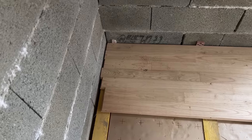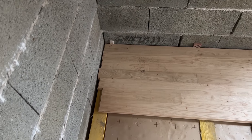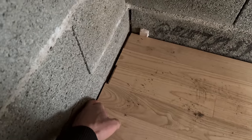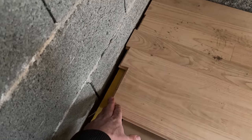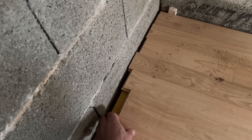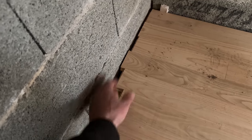I've stopped there for a couple of reasons. I want to talk about why I've left gaps at the side. You can see I've left quite big gaps there — at the end of the day you need expansion space. In summer the wood can move. I'm not too bothered about this gap here because we're putting insulation on the wall and then the rail for the plasterboard, which is probably going to cover it.